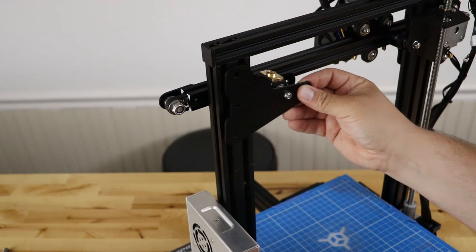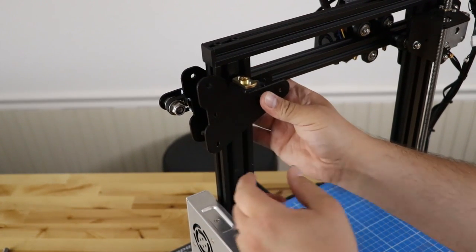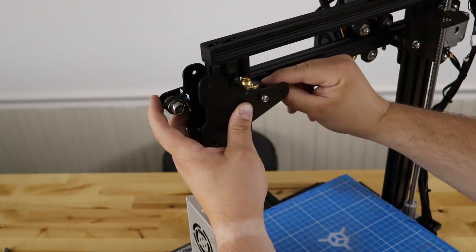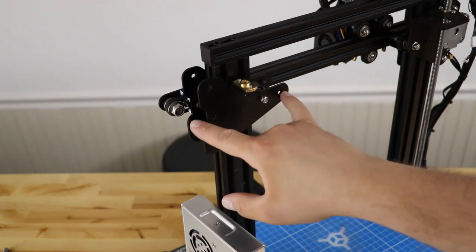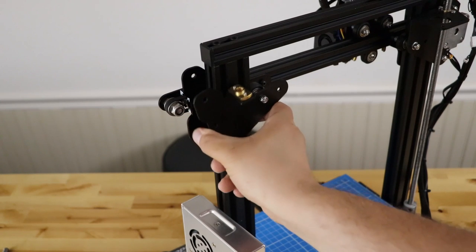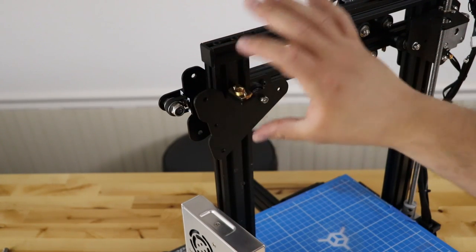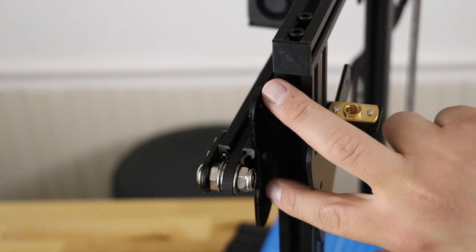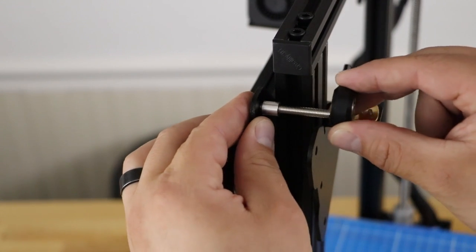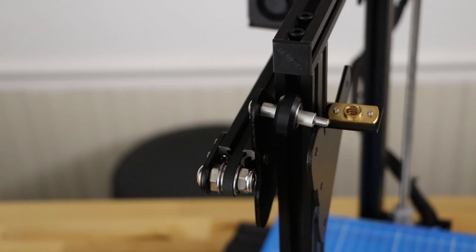Take the piece we just assembled and slide it right behind the frame. Make sure the screw sits in the little divot in the frame on this side. Take the two bolts that originally held the frame piece and put them in — get them snug but do not over-tighten, because we'll be adjusting the x-gantry. Slide the bracket down just a hair to make it easier to put the wheels in. Reinstall the two wheels: start with the bolt, then the spacer that came with the printer, then the wheel, then the new spacer from the dual Z kit. Line the bracket up, push the bolts through, and install the last two lock washers on this side.